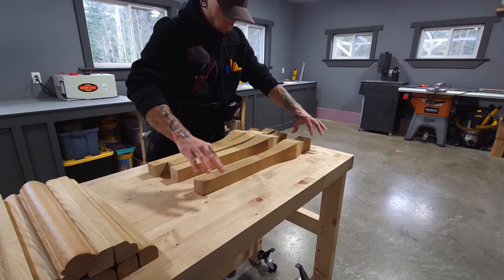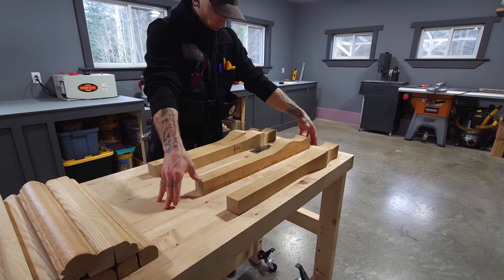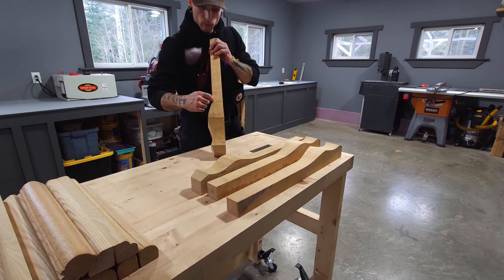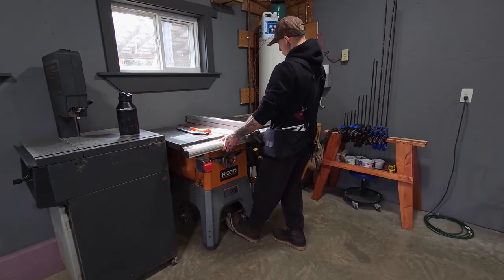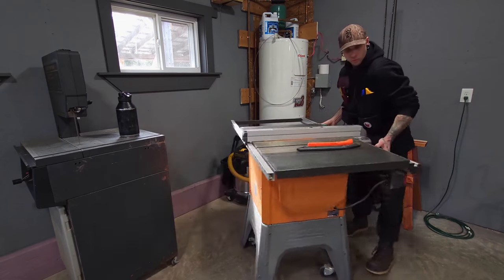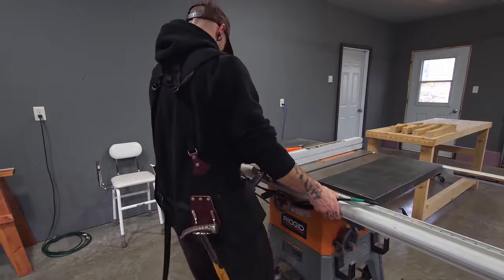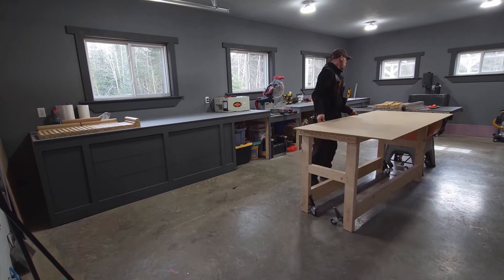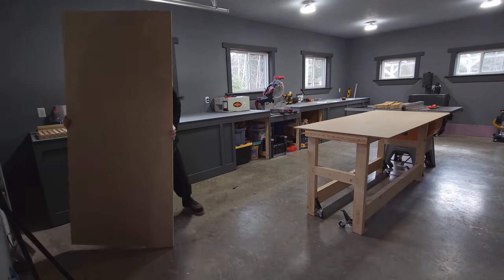What you see me doing here is checking for the flatness and straightness on the surfaces that don't have any curvy design features, so I know I don't have to plane off any extra wood to give me a true surface to work with. The goal is to remove those curvy bits to leave me with square lumber to run through the surface planer. My plan was to use the table saw, but due to very dull blades combined with fairly thick pieces of wood and the fact that this is only a 110-volt table saw, this plan quickly eroded, forcing me to switch to the bandsaw for resawing.